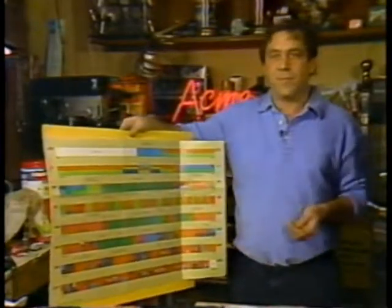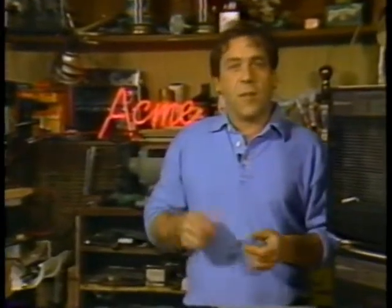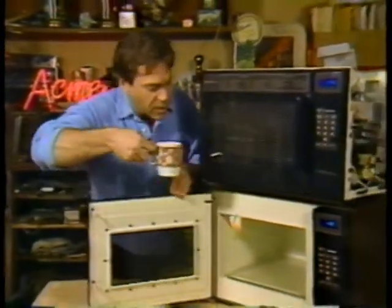The various radio waves travel differently. AM radio will reflect between the Earth and the ionosphere and go right around the Earth. Television signals act more like light — they disappear over the horizon in 30 miles or so. The microwave energy in ovens acts a lot like light. And there's a further interesting property: it'll heat food. Microwave ovens heat mostly the liquid content of the food — that's why simple foods cook the best. Foods with wet and dry components mixed need special treatment. The microwave energy wiggles the molecules in the food directly, so the oven heats the food, not its container or the air inside the oven. The wavelength of the energy is about 4½ inches. Aluminum foil is okay for shielding a chicken's wing from cooking too fast, but you have to watch out for metal things like the metallic glazes on coffee mugs — their diameter makes a good microwave antenna.